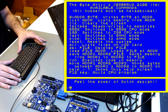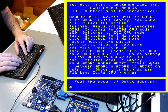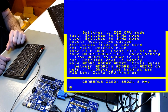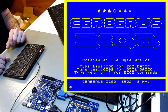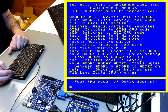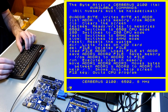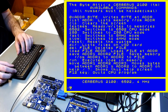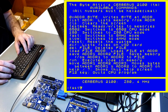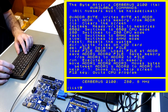There are commands to move memory contents, load stuff into memory, and save from memory, but no assembler — so you'd have to program straight in machine code. You could call the BIOS a monitor; it's a bit more because it has a file system. If I type 'reset', the machine restarts but doesn't destroy memory content — very important. You can type 'z80' to switch to the Z80 CPU, then 'fast' for 8 MHz. Currently we're at 8 MHz on the Z80.